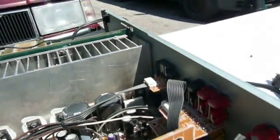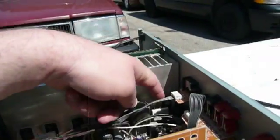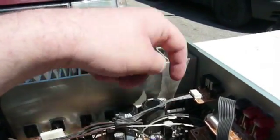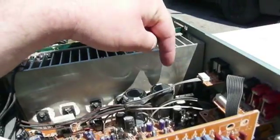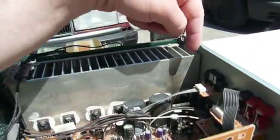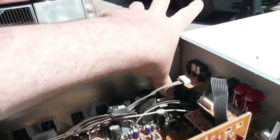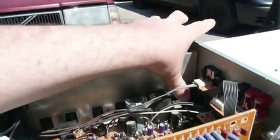Burned parts. These two transistors over here are dead shorted. And they've blown a couple components off the board. There's a little something down in there I think might have been a diode once upon a time. It obliterated the markings on the board, so I can't tell for sure. And then there was something else over here, and I can't recognize it either, and it doesn't seem to have any markings on it. But you can see it left a little chimney trail of smoke.